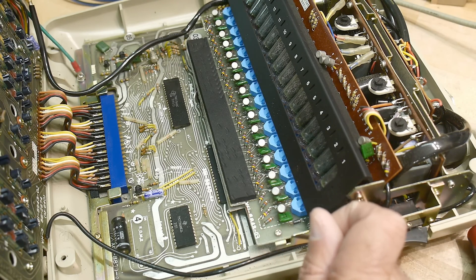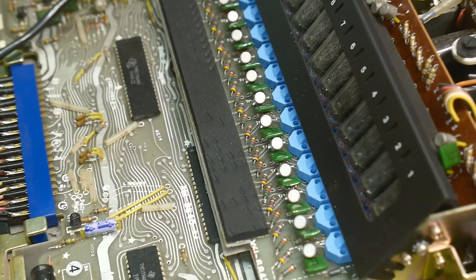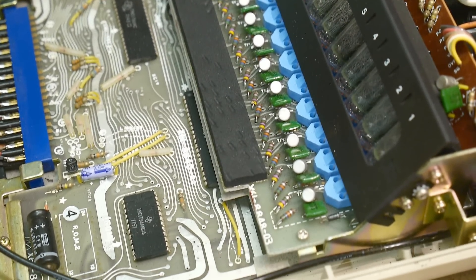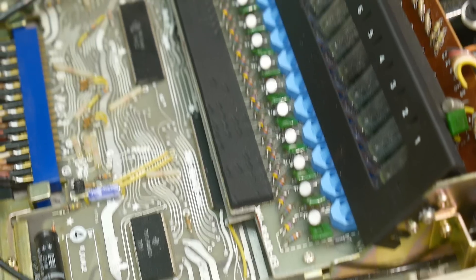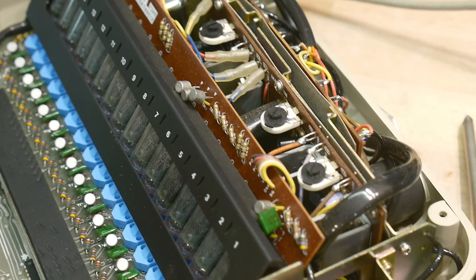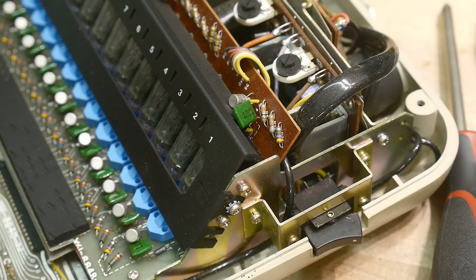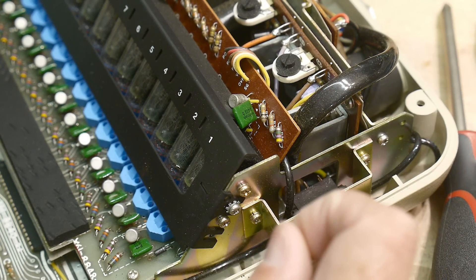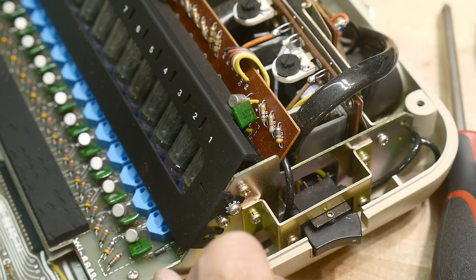Hand laid out board, of course. This is around 1974, I think. These are really old school Japanese transistors in a funny package — I think only Japanese manufacturers made those. A lot of the capacitors could probably need changing eventually, but it does work. The Nixies seem to be a little bit on the soft side. Let's swing this around and take a look at the back — some more power supply stuff back here with normal power supply components and a fuse in there.